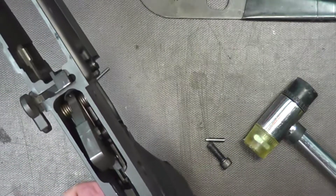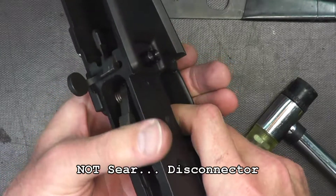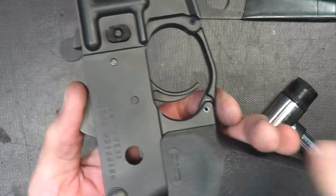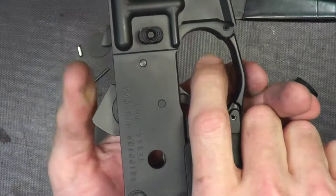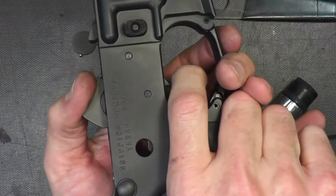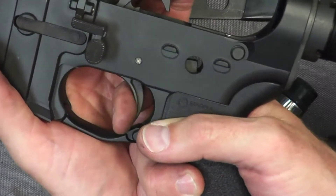That little screw inside is coming up and pushing up on the back side of the trigger. You can't go too far with this because the sear won't work. I've done it too far at this point — when the hammer gets cocked back, the disconnector grabs it but won't let go, so the gun will not shoot again. I need to back that screw out a little bit. There's the click — that was the disconnector. You need to find the right spot; now we've taken up the take-up.